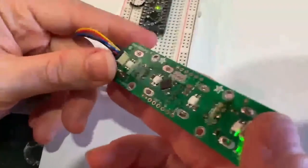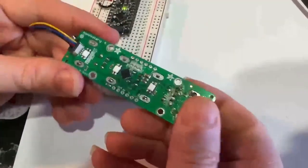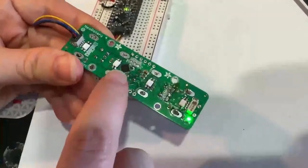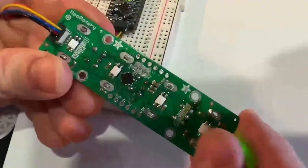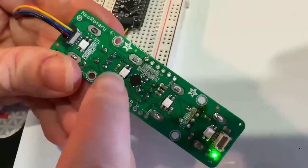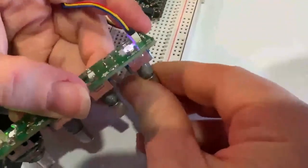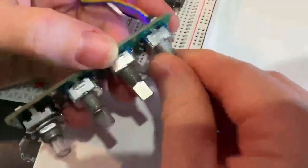This is me working on a new prototype. This is a quad rotary encoder to Stemma QT converter. It's got an ATtiny817 that's reading all the encoder pins and the switch pins, and there's even underlit NeoPixels. For most rotary encoders, you actually can't see the LED.